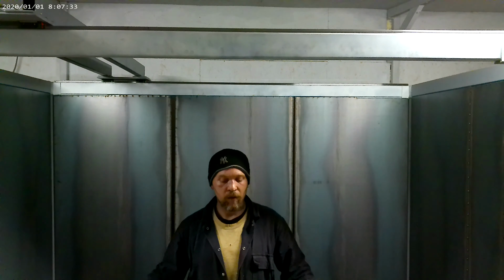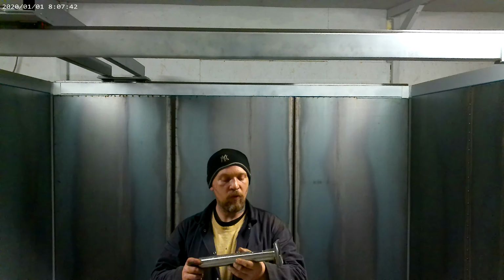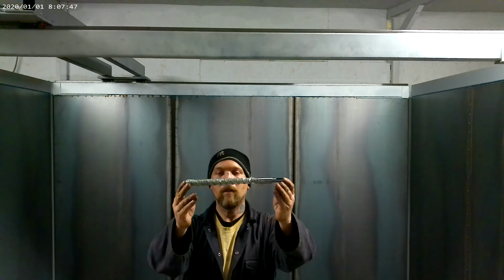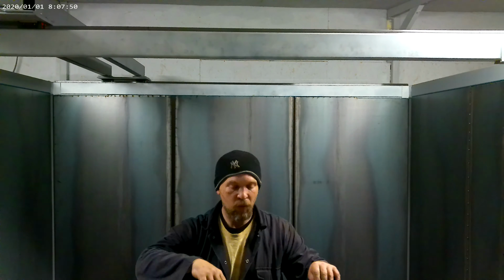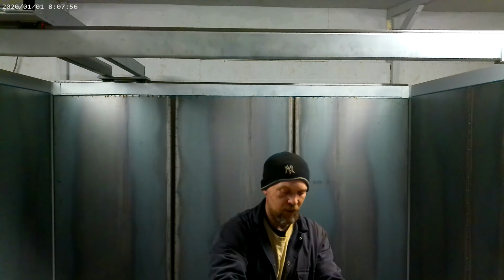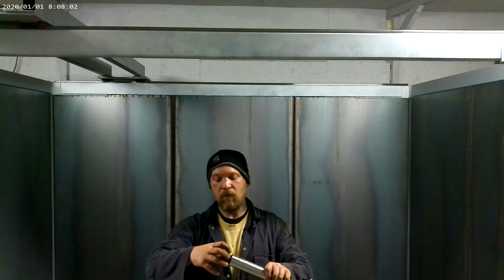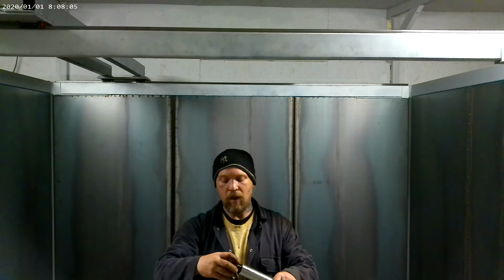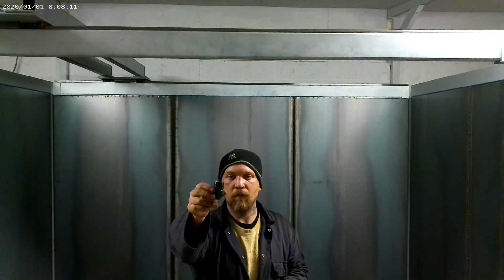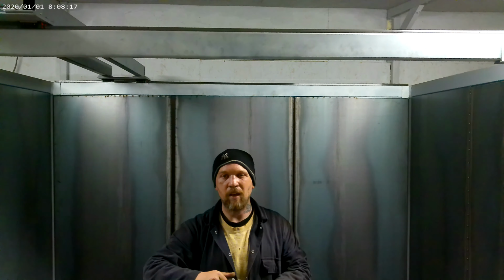So, we'll go straight in. The pellet extruder itself. This is my pellet extruder. This is from Robotic, around about £200. 20mm screw, so not too bad. It's actually quite nicely made. I did buy plenty of extra bits. Let's show them over here. There we go. Those are extra nozzles, so to speak. Different die sizes, extrusion sizes, hoping to try up to about 5mm if I can, if not higher.